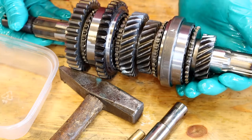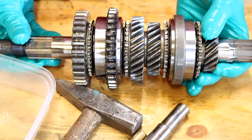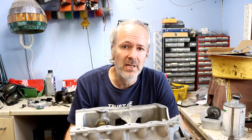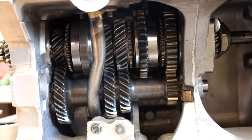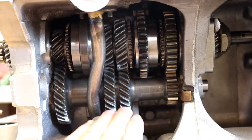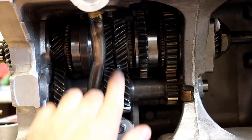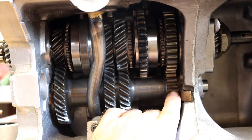Obviously the first motion will come off anyway, but that is how it should look. So that's all I'm doing for this video — you've now got the main shaft all built up, and you then go on to building the gearbox itself, which is for another video that I've already done. The last thing I want to point out: if you get confused as to which gear goes where on the main shaft, just lay it next to the lay gears. The lay gears are fixed, so this is the big end and this is the small end, and there will be a corresponding gear with each one. Also worth remembering that at this end you have a straight cut gear which is first gear. Anyway, I hope that has been of help — stay tuned for more videos.